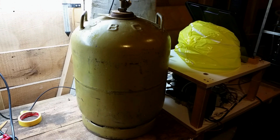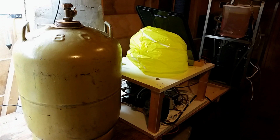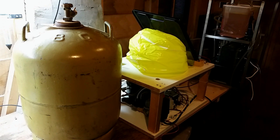The generator produces about 70 liters of hydrogen per hour, so this tank will be full in about 8 hours and will then contain 550 liters of hydrogen, which will cost around $1.20 — so that's 0.2 cents per liter, a lot cheaper than helium. The advantage of using old propane tanks is that there will always be a little bit of smell added to the gas, which is good for safety.